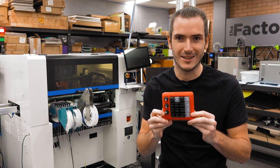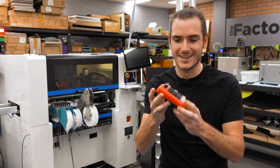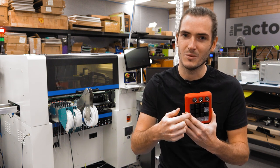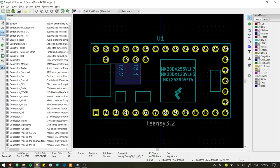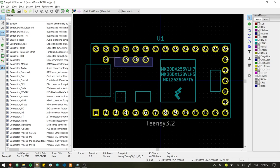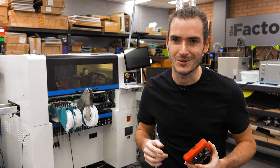A challenge with making usable electronics is fitting it all into a reasonably sized case. The keypad has a Teensy mounted on the rear side of the board so I can fill the front with more cool buttons and knobs. That means pins from buttons and knobs come in from one side and pins from the Teensy from the other, so to accommodate the overlap I modified the Teensy footprint, deleting the unnecessary pins. This recovered enough real estate to mount the Teensy under the middle rotary encoder — those pins are unused so it'll be fine.